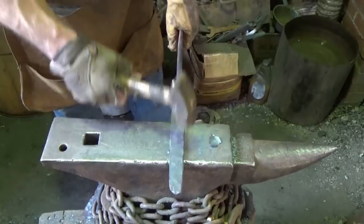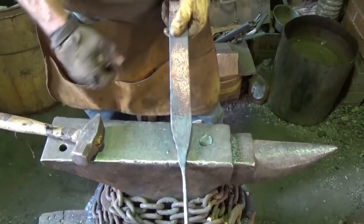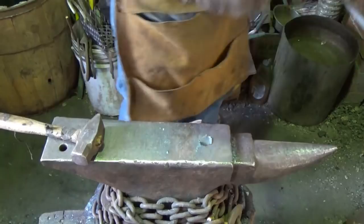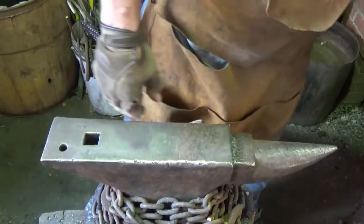It's cooled right down on us. So now we have — it's a little over an inch back here — I'm okay with it. I was hoping to get back to a greater length, but I think that'll hold the handle just fine. Now I've got to decide whether I want to put the bevel on this piece before I forge weld that eye or not. This will give me an extra handle to put the bevel on. I'm going to normalize this thing because it went through a heck of a lot of abuse — we'll run through a quick normalization process, and then we'll start putting the bevel in on the blade.